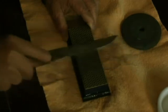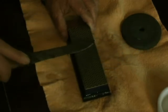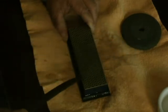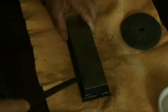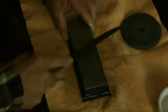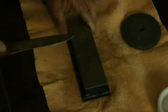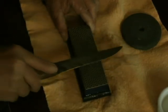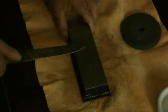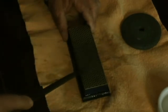This knife is going to take a little bit of work because it is so dull. It has been abused, left in the barn, and it's got a little rust on it. But I grabbed a knife like this to show you specifically that you don't have to start off with a knife that will already peel an onion or slice a tomato. Just make the same number of strokes on each side, and don't get tired of what you're doing because it doesn't seem to be bringing up an edge right away. You may have to work it down a ways to get the proper angle.